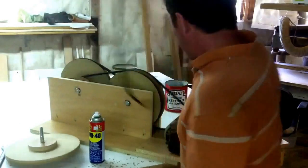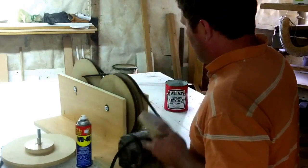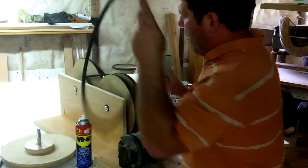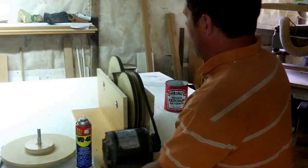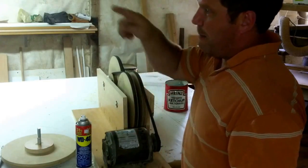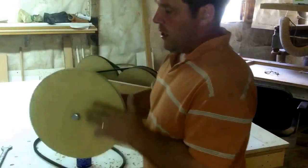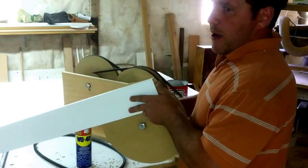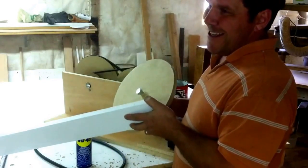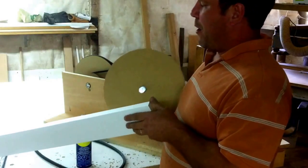If I came off this again with another pulley on the inside one and went with a little bigger pulley, this pulley would spin a little bit slower. I'm aiming for about 30 RPMs on the last pulley, because some of you may have seen my other video showing the pocket hole machine. Instead of having to push on the foot pedal — check it out, it's a cool foot-operated pocket hole machine.